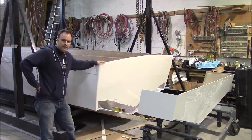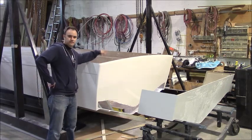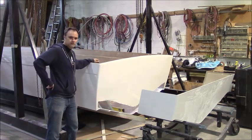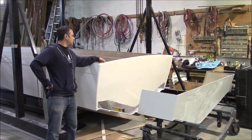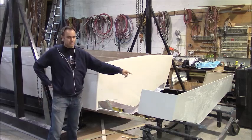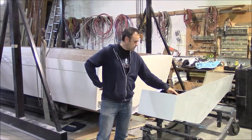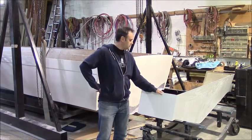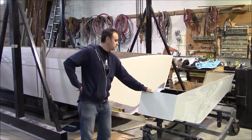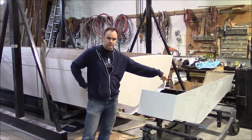When we lay up a hull for a 25 and a half footer, we don't need the extra reinforcement in the transom because we're going to cut it out. So we have one layer of three-quarter inch plywood at the top here, but the strength we need is back here. When we laid this up, we've actually got three layers of three-quarter inch plywood. This boat is going to have twin 150 horse Yamaha outboards on it, so depending on the kind of power it has, the thickness of the plywood will vary.